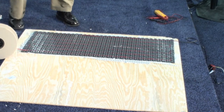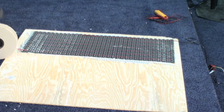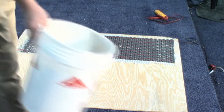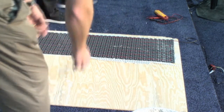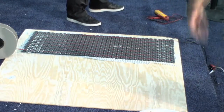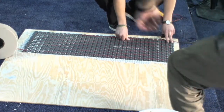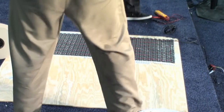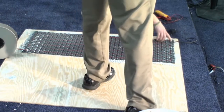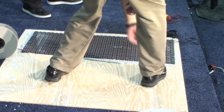Also in your thermostat box is the floor heat sensor, the temperature sensor. This is going to run down the wall with your cold lead, and this is what gauges the temperature of the floor. So you're just going to bring it right into your floor. We say bring it in at least a foot into the room. And then that just gets thin set down with the heat cable.